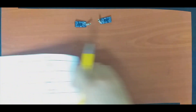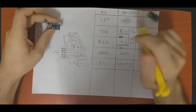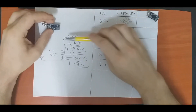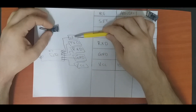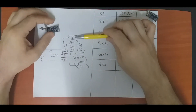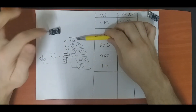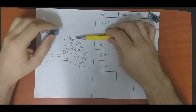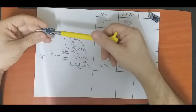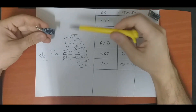Let's talk about the wiring. This module supports UART and has five pins: SET, TX, RX, GND, and VCC. The SET pin is only used if you want to program the internal parameters of this module — such as power, channel, and power mode. Otherwise, just leave it floating.